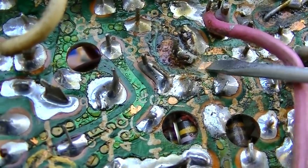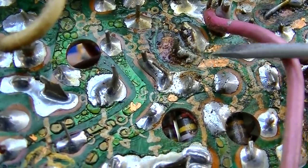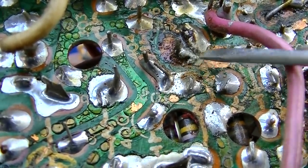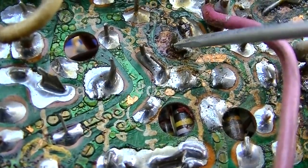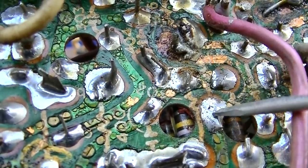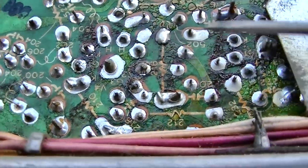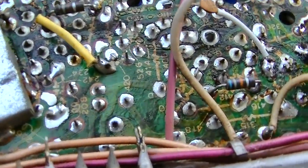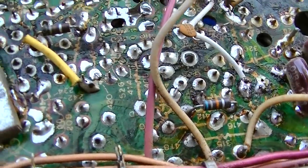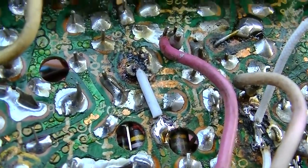No wonder we're not getting any plate voltage to the sync separator. What I'm going to do is take a jumper from here to here and just bypass this broken trace. Like I said at the beginning of this video, Sylvania sets have garbage traces — they just peel off, like aluminum foil. Alright, so there we go, our repair has been done.